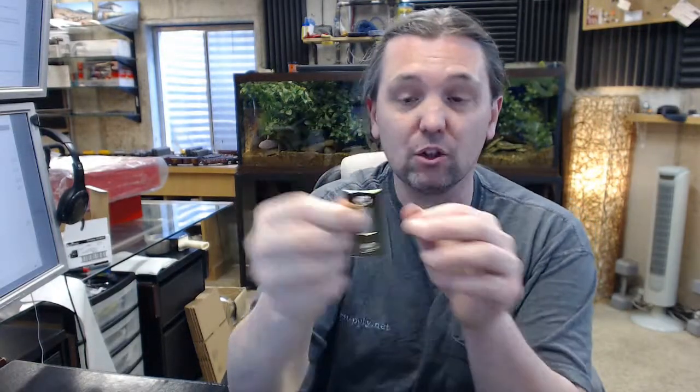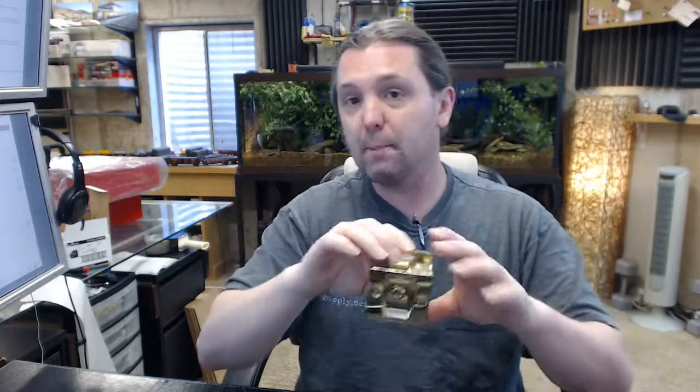This is quite thin — it would require a very sharp chisel to make it look nice. It is too thin to have a router really do the job. Be sure that you pre-drill your holes before screwing the pieces onto your door and frame. When I put this on I like to put an ever so slight one-degree angle on the screw so that when I tighten it down it will have the action of drawing that back a little tighter than standard against the edge of the door. Time and practice really dictates how that is done.